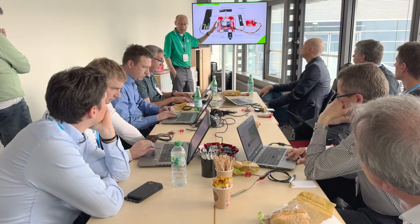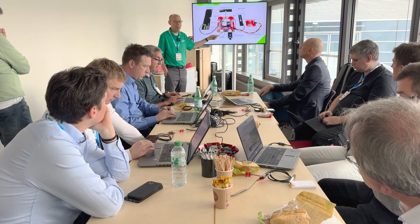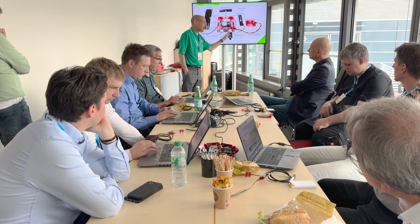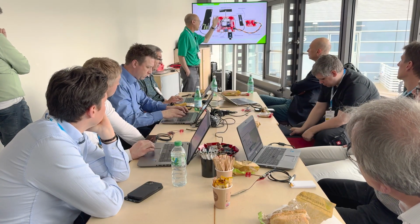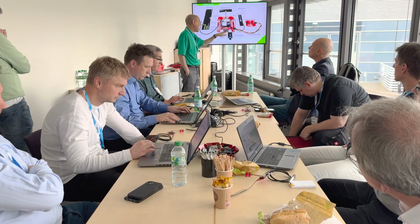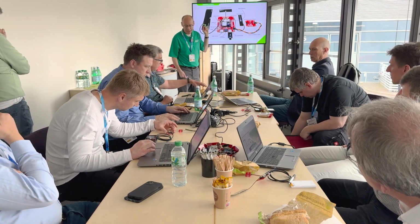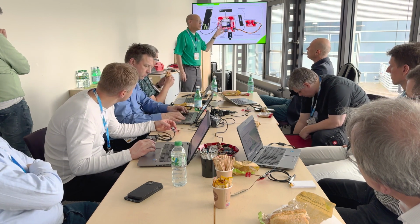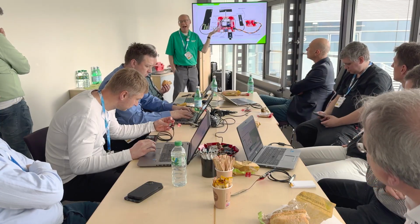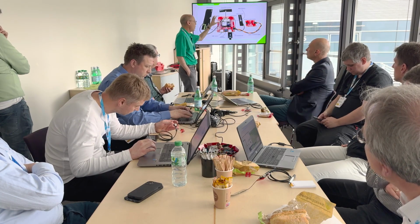And a couple other things to point out about your development board. There's a battery connector, so you can plug in a small lithium polymer battery. And this USB connection provides both data access, so you can talk and configure your XBee module, but also will provide power and charge the battery. So if you plug a battery into these, you can get it charged directly and use this as your main prototyping platform. So you can grab that, take it out in the field, it's got a battery. When your battery is flat, come back in and charge it up again, all on the same board.